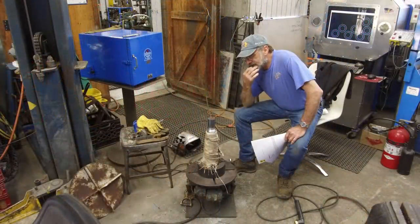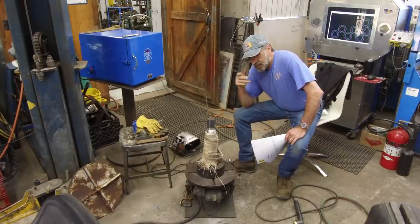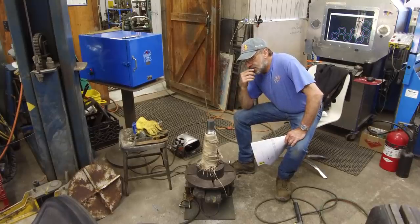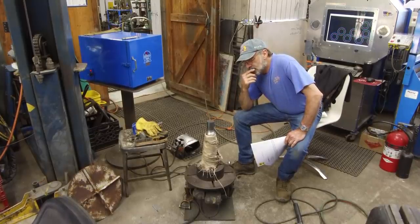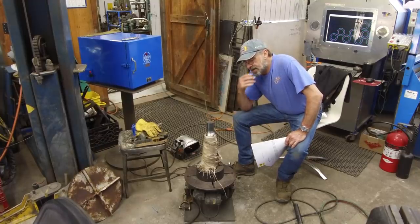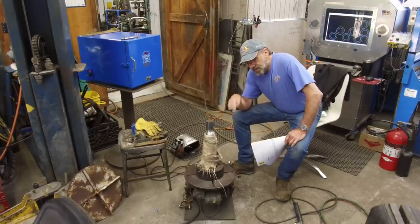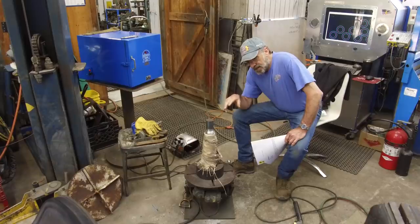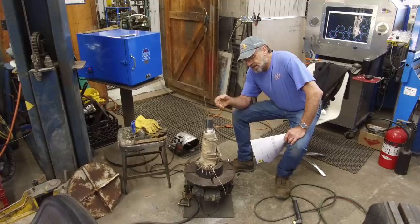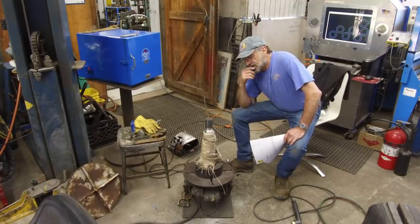Just had some lunch here and been regrouping. I've got other rod in the oven there that I'm going to be changing to. Now, I stuck this in a lathe and I machined the weld that I just put on there off. And the entire amount of rod, there was some good areas, but the majority of rod I laid on there showed a content of porosity